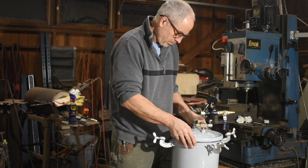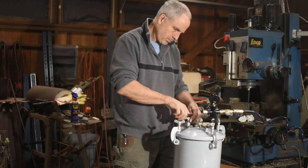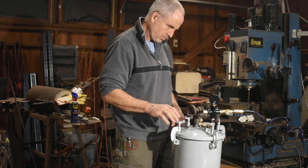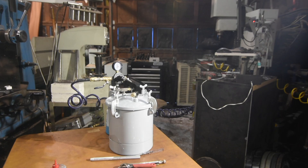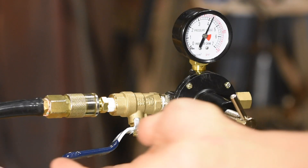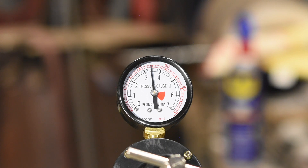And that's it — you're good to go. To fire it up, you just place your mold or molds into the pressure pot, close the lid, tighten the handles, connect your air, and use the valve to pressurize the tank. Then the super cheap gasket leaks like crazy. It generally seems to settle in after a while though, and once it does it'll hold pressure for a really long time — more or less overnight, losing maybe 5 psi, which is pretty good. If it continues to be an annoyance, I may try using silicone caulk to make a gasket myself, but it seems to be holding up okay. You just have to jiggle it around a bit to get it to seat right.